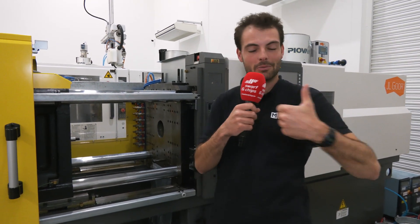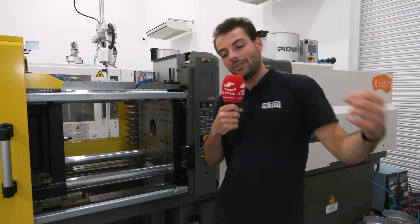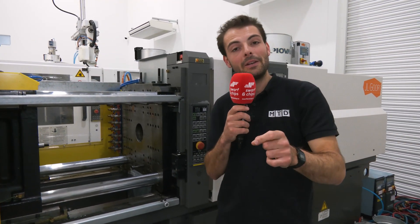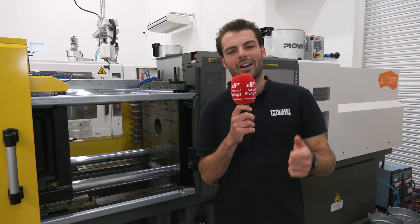Part cycles are generally about 5 to 15 seconds. The mould closes, injects the component, the part cools down, the mould separates, and the part gets ejected every 5 to 15 seconds depending on the size of the mould. With the EpiPen mould that's 16 impressions, so it makes 16 parts every cycle — that can be 75 parts a minute or 4,500 parts an hour — and these moulds run 24 hours a day. That's why it takes so much design engineering work to keep them running.